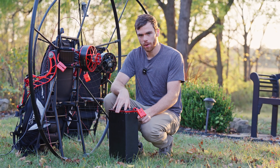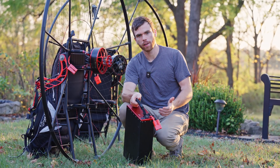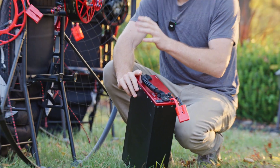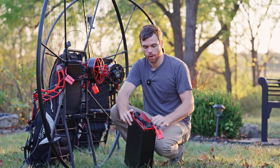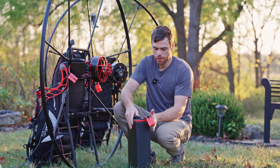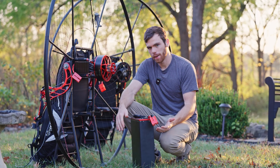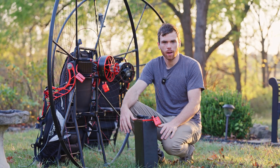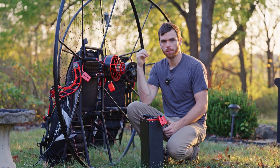And then finally, the battery pack. This just got redesigned recently and is now fully integrated with this system, so it complements it perfectly. We tried to do a forward-looking design to make sure it worked with this new system. The existing 2.5 battery packs will work perfectly with the system — this is what we ship right now. It has a communication port on top, discharge buttons, an auxiliary port, and a nice new handle versus the old one which had little straps on the side that weren't as comfortable to carry. This new case is an aluminum case for better cooling, it's a little bit shorter in overall size, and the biggest improvement is a 30-35% capacity increase, allowing 30-35% longer flight times with the same battery pack. It's also backwards compatible with V1 frames and V2 systems.